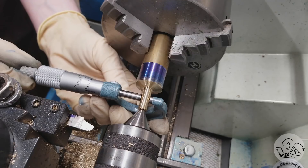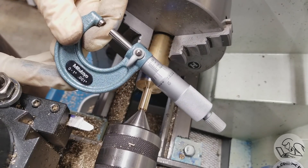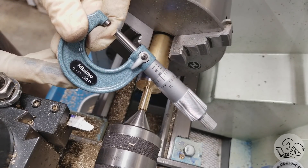There's that finishing pass — you can tell when you've got a really fine surface finish on brass because it takes on a golden color instead of the matte yellow it normally has after machining. That turned out really beautiful. Of course it's overkill because we're going to be cutting threads on this, but it's still nice. The thread needs to be M8 by 1.25, so I'm going for 311 thousandths — a few thou under 315 which is 8 millimeter — and that will do nicely.